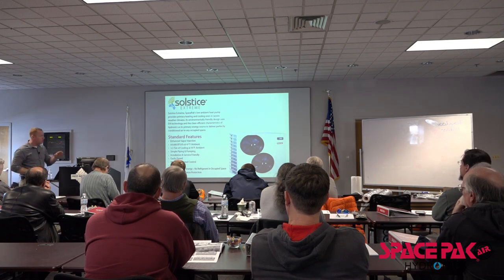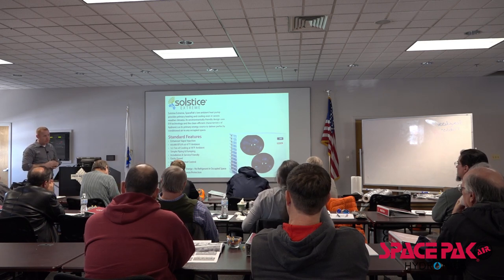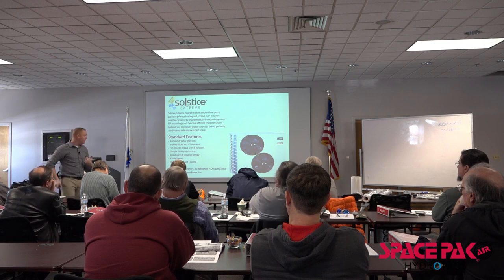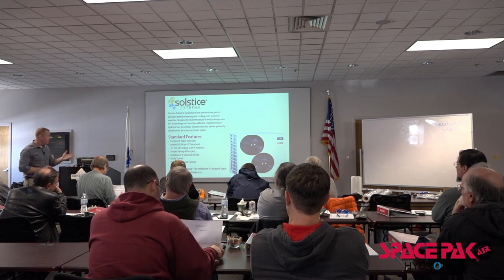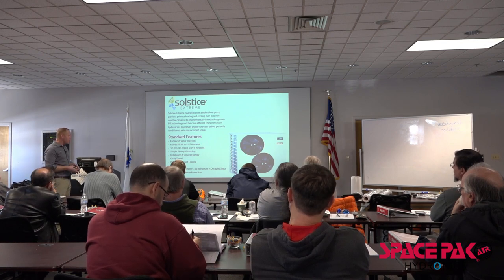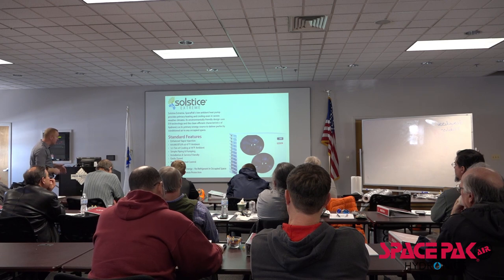The goal for our low ambient heat pump, we call it our LAHP, is to deliver higher water temperatures at lower outside ambient temperatures, right? It's harder because we're getting our temperature from the air, and the colder the air gets, the less temperature we can get from it. What do we have here for standard features, right? We've got 64,000 BTUs of available delivered temperature at 47 degrees. We also have 3.3 tons of cooling at 95 degrees. Again, we're user-friendly here on the water side. Easy installation. We've got some outdoor reset. We've got modulating fans and low ambient freeze protection, things like that.